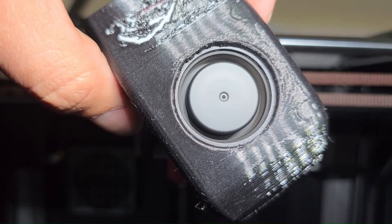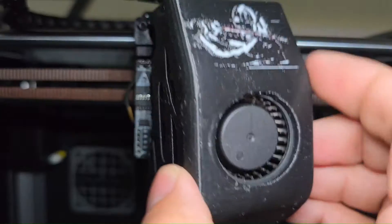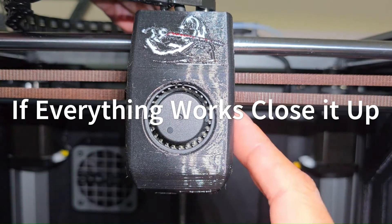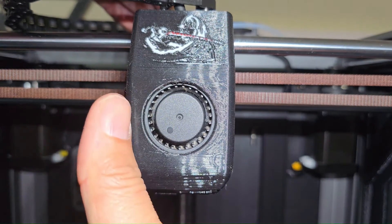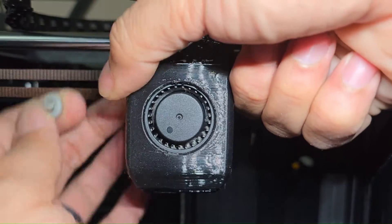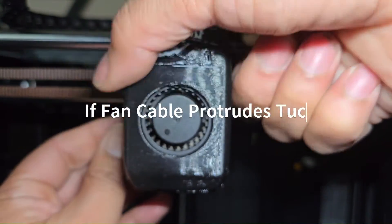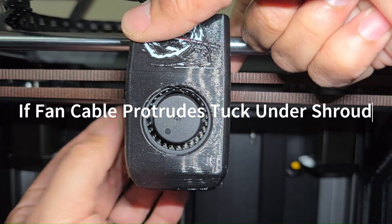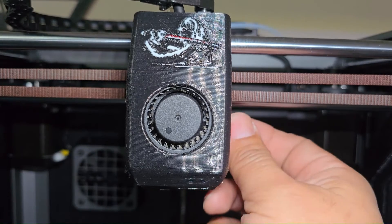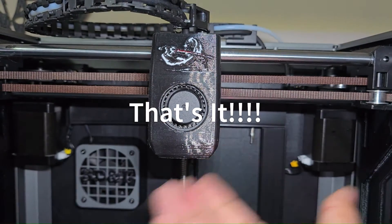Let's turn it back on — yep, we're back in business. Let's remount it up on top of the printhead and put the screws in on the right and left side. I have some custom screws here, but use yours — screw them in on the left and right, nice and tight to keep it in place. Sometimes the hot cooling fan wire will get in the way; just tuck it behind the shroud and screw in your left and right sides.